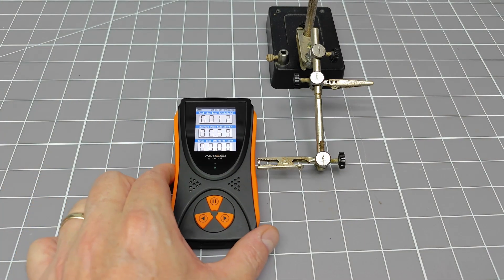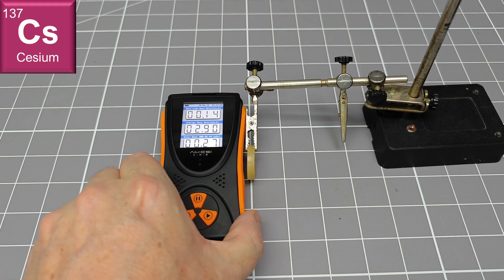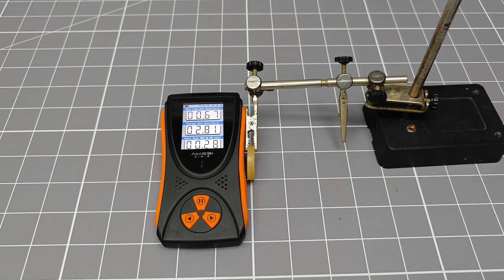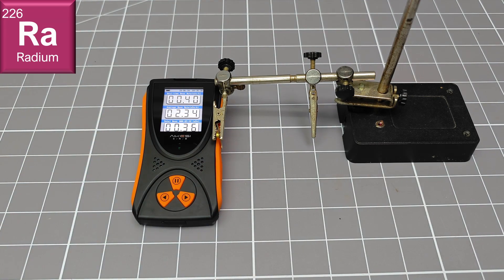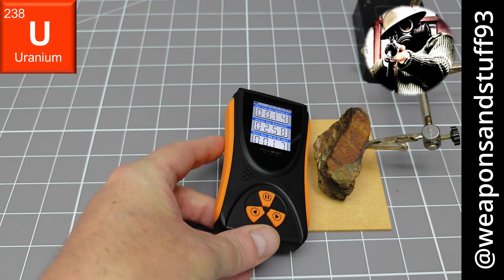Next, I am testing the response to an americium-241 source. For a detector using a Geiger-Müller tube, I would normally expect this to measure at about 3 microsieverts per hour. But the HFS 10 is only capable of getting a reading that is about one quarter of that. I also tested with some of my other check sources — namely cesium-137, radium-226, natural uranium and strontium-90. All of these gave very low readings, about 4–5 times lower than I would have expected. The product datasheet states that the device is capable of detection of beta, gamma and x-ray radiation. It seems that the device is just not sensitive to beta radiation at all, and that the gamma sensitivity is also quite low.